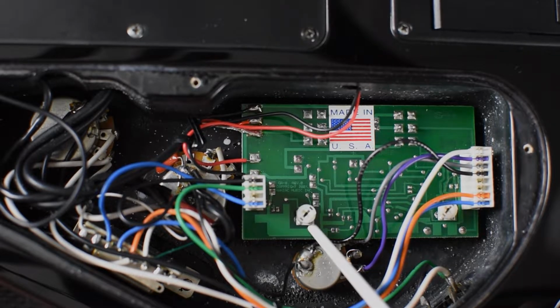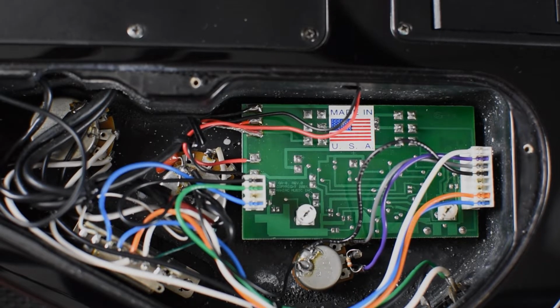This trim pot adjusts the total gain of the transducer, increasing or decreasing the sustainer's overall effect and creating a maximum output limiter. This is similar to the volume limiter on your smartphone that prevents you from turning your earbuds up too loud. This control is entirely separate from the drive knob, which we'll discuss in just a moment.